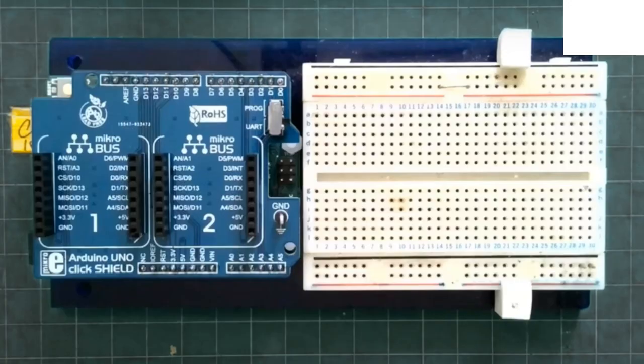There's an Arduino Uno shield that'll take two mikroBUS anythings. Well, I'll give you an example. We were looking at a shuttle, myself and Davey, recently, and one of the things we were trying to do was make a signal that's both variable frequency and variable duty cycle. In order to do that, we needed to control a high-speed clock that we could then divide down to make a lower-speed variable duty cycle signal. And in order to make a high-speed clock, I simply plugged that high-speed clock chip into it, and five lines of Arduino, and we were off.